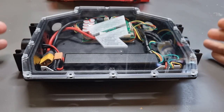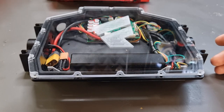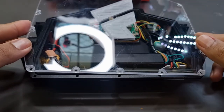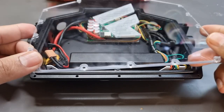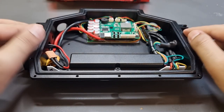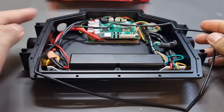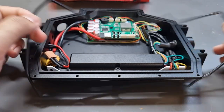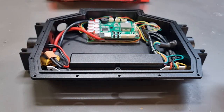Finally, let me break down the front box — there have been a lot of questions. First, we see a polycarbonate lid. There have been questions about its rigidity, and I can assure you it can take impacts, maybe even better than an aluminum lid, because it flexes and comes back to its shape. Once you get the lid off, you're met with a gasket — a custom-made PTFE gasket with just enough squish to let the lid sit on the box, tighten all the bolts, and make everything inside waterproof, dirt-proof, and whatever-proof.